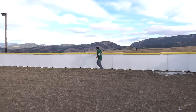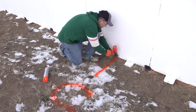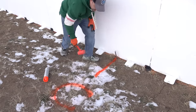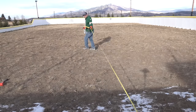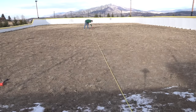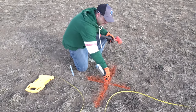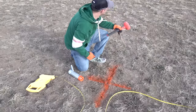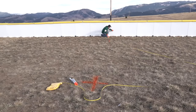Counting one, two, three, four, five, six boards — we'll put a stake as close as we can to the boards and that'll help us find the center. I actually marked this previously just to speed up the process with filming, but we'd mark our hash for the center and then measure out from the side. You can see our center line is lined up with the middle of this board, so we'll use a stake and then measure in to find the center of the rink.